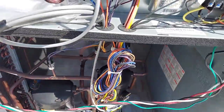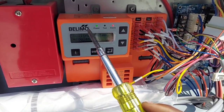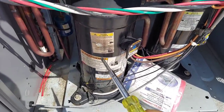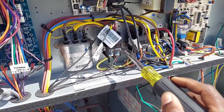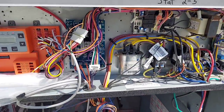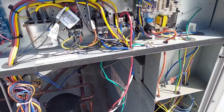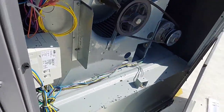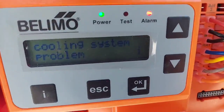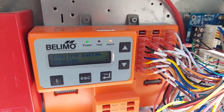If you run it backwards for an extended period, obviously it's going to overheat, and that's what happened to this one. I don't know why this one shut off — maybe this device here turned it off. This one seems to have kept running backwards and you can see it's hot to the touch. When I initially hit the contactor it didn't turn on — it had already cooled down. So I'm gonna flip the rotation. That's crazy, but I'm excited about this new component because I've never seen one of these in a carrier unit before.